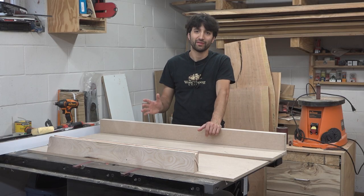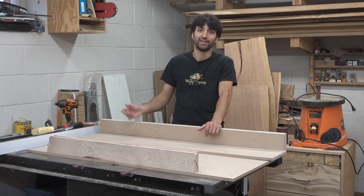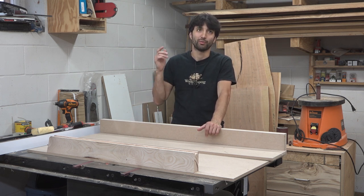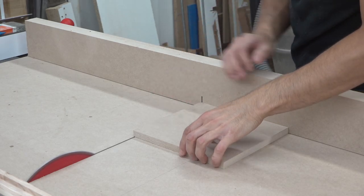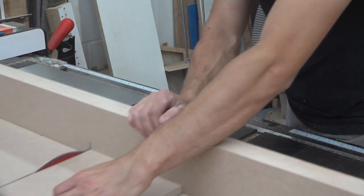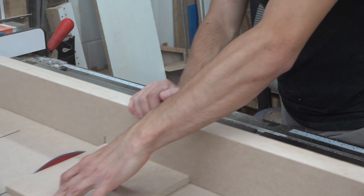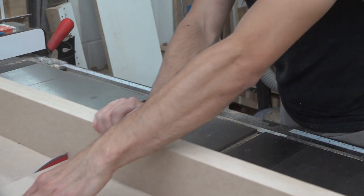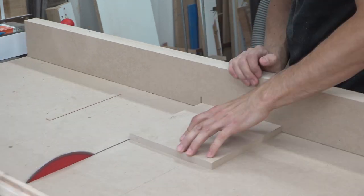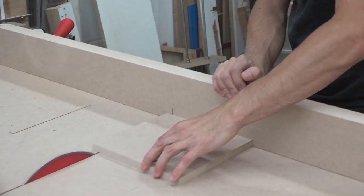To check this thing for square, I'm going to use the five-cut method, popularized by William Ng in his crosscut sled video. You can also find it in the Wood Whisperer's video and Nick Ferry's video on their crosscut sleds — I'll leave links in the description. This method works on the principle of exaggeration to make the error in the sled very easy to see. You take a scrap piece of wood, make four cuts referencing each cut against the fence, and on the fifth cut make a strip. If the fence is perfectly square, the two edges of that strip should be perfectly parallel, and you check that by measuring both ends and comparing the numbers.